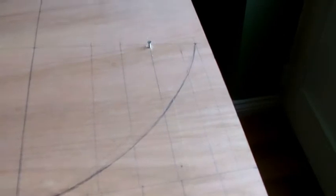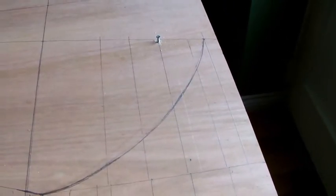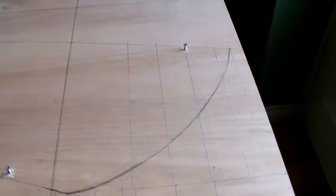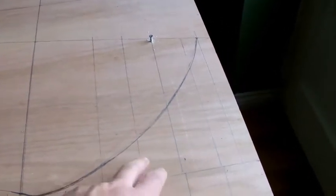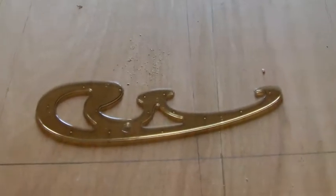This is the bow. The bow and stern basically, because it's going to be duplicates of this. There's a 50mm grid that I use, and it helps me get the curve on some of the panels. I also use a little stencil called a French curve. It's one of those - so that just helps me, because I'll freehand draw that curve in.